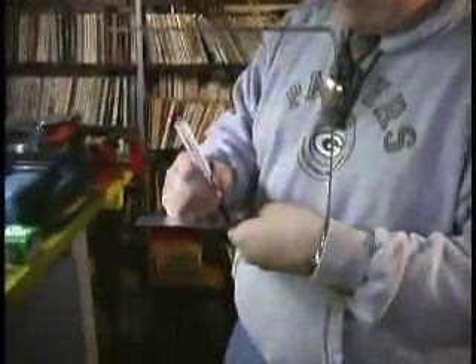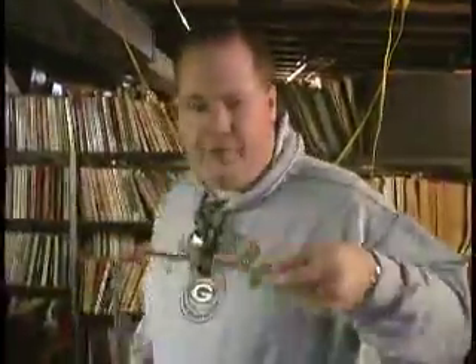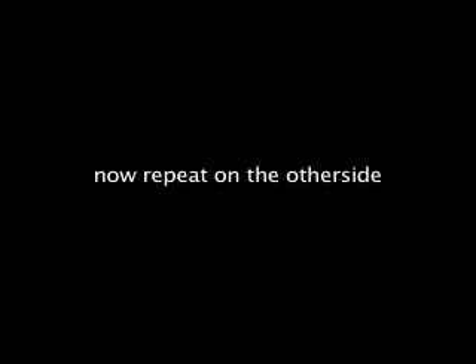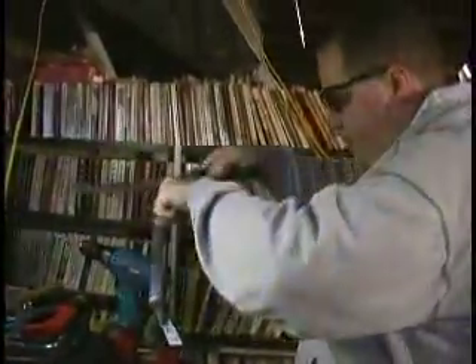I've marked where the camera's going to sit. You're going to want the hole right about there. It doesn't have to be perfect, but it needs to be pretty much in the same area so the Steadicam and its counter bracket stay balanced. Use a quarter inch drill bit — again, safety glasses on because you're drilling into metal. I have my mark, start off slowly. Clean up any extraneous shards or threads. Inverting bracket is done — woo-hoo!